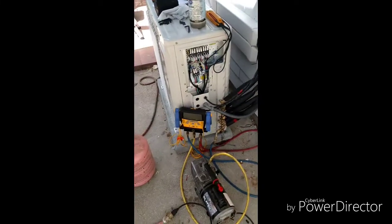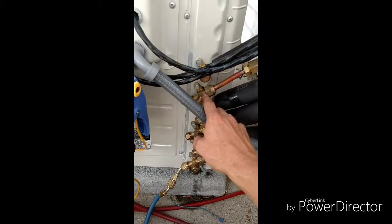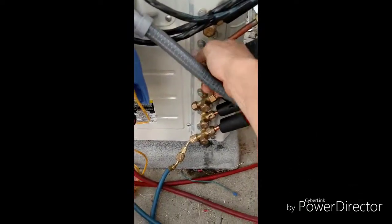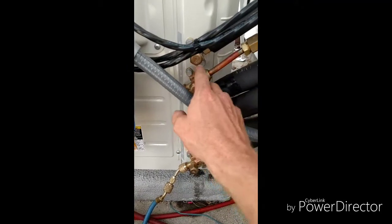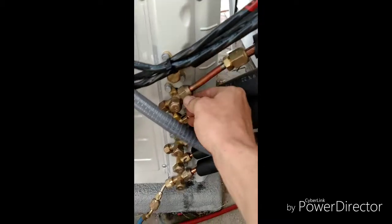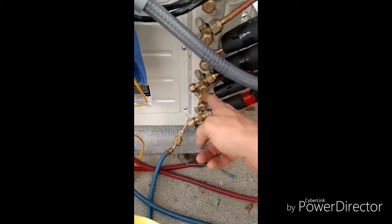Once you're hooking this up, there are two valves here. Once you pull your vacuum through the low side port, turn your valve off so your pump is disconnected and you're holding vacuum. Then take this nut off here and this nut off here — there are allen wrench valves inside. On this particular unit, start with your high pressure side, the quarter-inch line, not the half-inch line. Release it slowly so it fills the line, then release this line and move on to your next set.